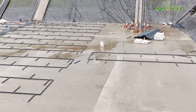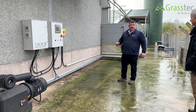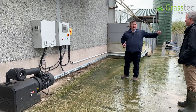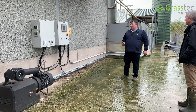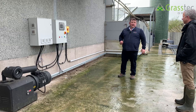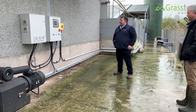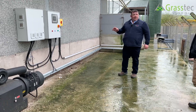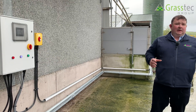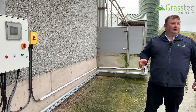This is a high flow red blower which we've put on here, along with our control panel. The control panel has a PLC involved in it, so whatever system we want to add on in the future — this customer is adding another 42 circuits onto an underground storage tank — we'll be moving this blower and control panel to a different location so it can cope and has the ability to mix it all. We have a multi-tank switch so if he just wants to mix the lagoon and not the underground storage tank, he has that option. If a customer has up to 10 tanks with five empty and five full, you can set it up to mix accordingly.